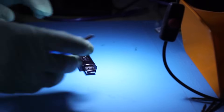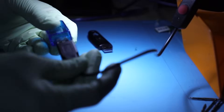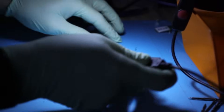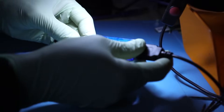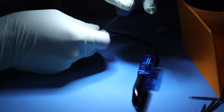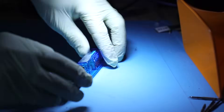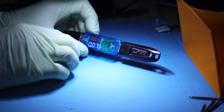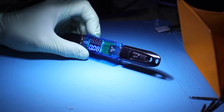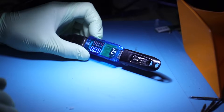What I'm looking for is right here — I've hooked this up to just a power supply, and this is going to show us what sort of draw we get. When the power goes on, there's a red button here. If we press it, that should start five volts into the unit, and the consumption seems like what it needs to be — 80 to 70 milliamps.